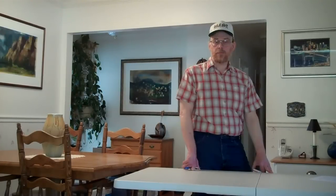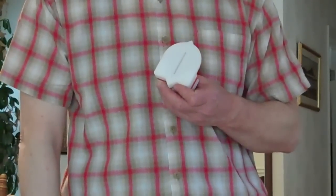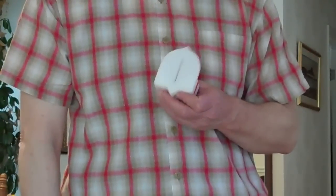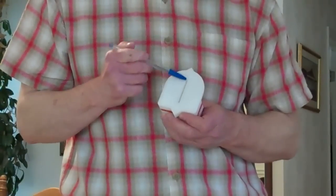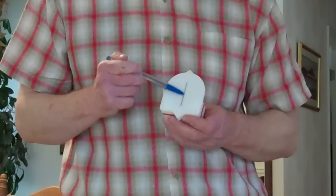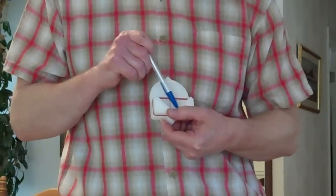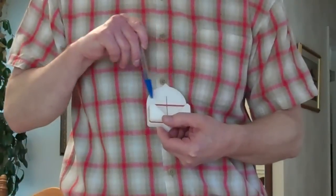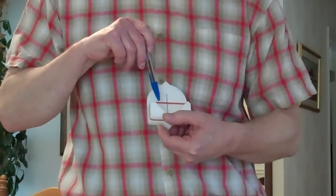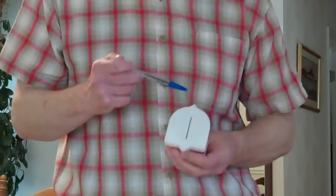How can one meet these criteria? I'd like to introduce to you the RETICLE TRUE alignment device. The RETICLE TRUE is CNC machined out of solid Delrin stock. The device itself has a vertical slot or a window to sight the vertical cross wire in. On the back, it has a V-shaped ledge to accommodate most any diameter of ocular bell, while at the same time it will automatically center or index that ocular bell on the ledge.